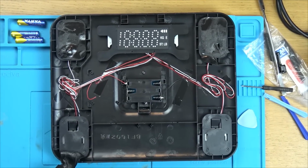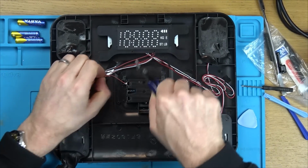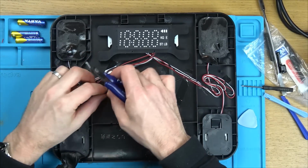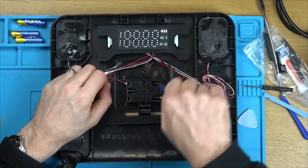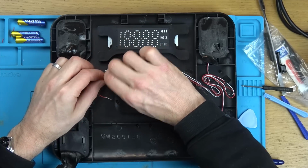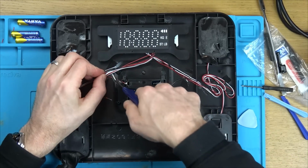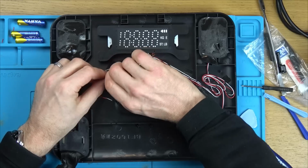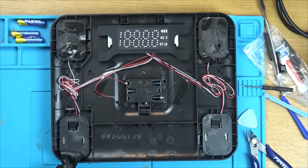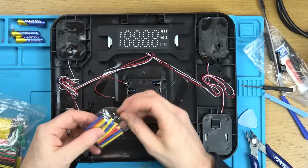Now, when I'm editing this video back, I was just thinking, why wasn't this picked up at the manufacturer? But I think I know why. So obviously, when it was assembled, these wires should have been grouped together through the gap, or this should have been on its own, so it wasn't going across that plastic bit. But to stick up for the manufacturer, when it was put together and the person tested it, because it was probably a different person testing them than the ones who were sticking the lids on, then you see it probably did test okay. Maybe the wire only snapped after being stood on 10 or 20 or 30 times, or perhaps by a heavier person, because the wire would have been intact to begin with, and it might have even worked for a few weeks or something before it failed. So obviously the wire is broken because it was routed incorrectly, but the reason it wasn't picked up at the factory is because I think this one did work when it left the factory.